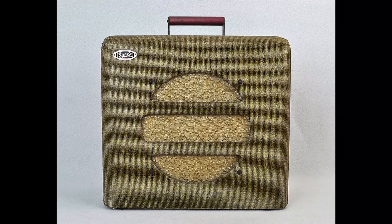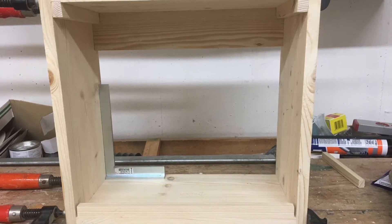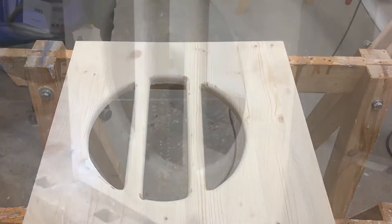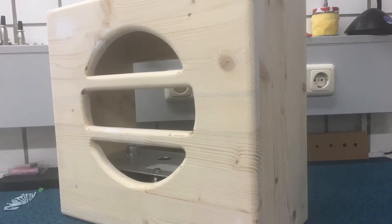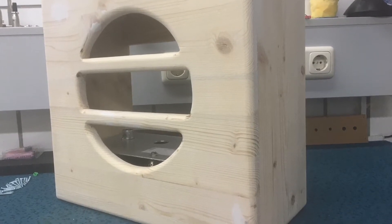Alright, time to get started — follow me to the wood shop. This is not a rabbit cage! These small amps had a quite simple design — square. But the front is, in my opinion, beautiful. As you can see, it's already routed and sanded, so time to glue everything together. Building a solid pine wood cabinet is very important, because rather than chipboard or laminated wood, a solid cabinet resonates like an acoustic guitar does.